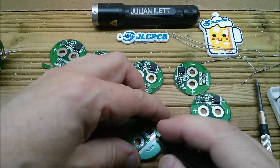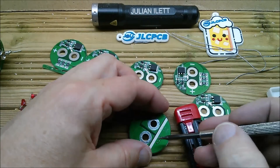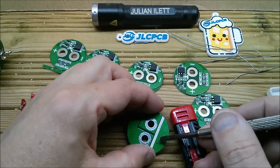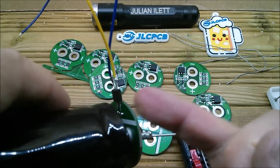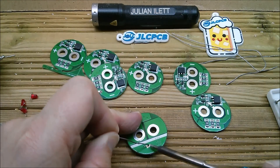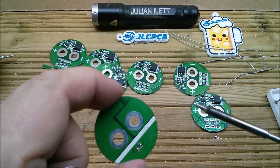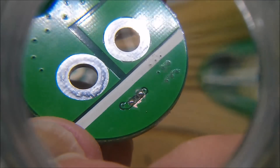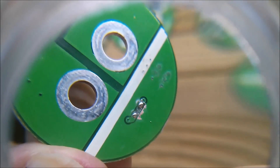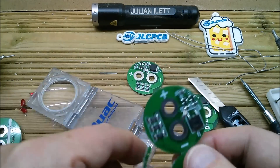Now I need to cut the tracks on all the ones which haven't had their tracks cut. Then with a screwdriver I'm going to scrape back the solder resist to expose two pad areas where I'll put a solder blob, and then the opto-isolator will solder across those two pads on the back of the board. Let's tin a bit of solder onto these pad points. That's where my opto-isolator is going to go. That looks like a broken track and it doesn't short down to the ground plane — looks pretty good.